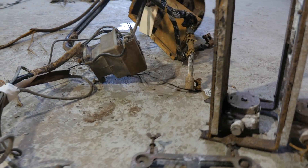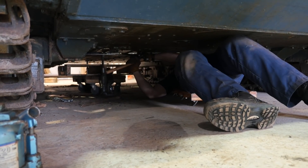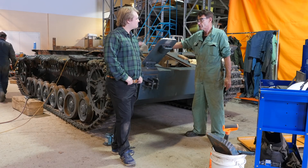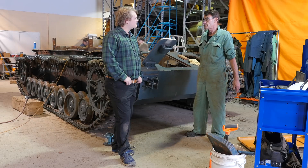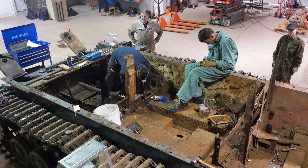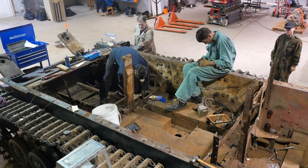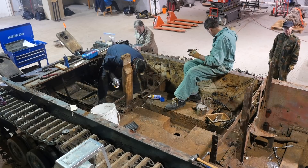We've got all the wiring now, all the infrastructure. We're working on the gas tank coverages, dropping the gas tanks from down below. And once we finish that, we'll be probably pulling out the rest of the brake mechanism, as far as up to the final drives. That'll leave the hull bare inside and clean enough to attack with the sandblaster. Then we'll replace the steel work that's rusted off.